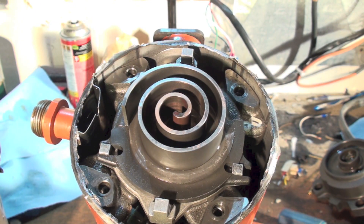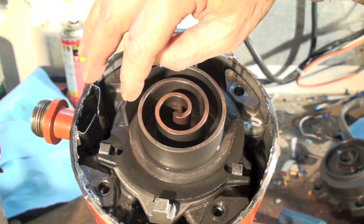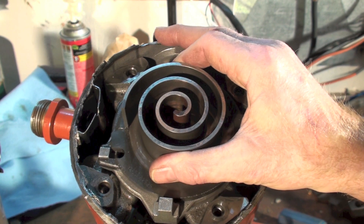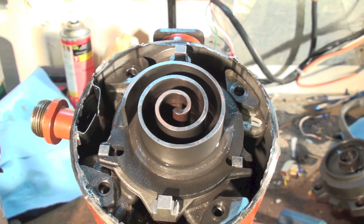The space gets smaller and smaller and it pumps the gas out. If you have liquid in there, instead of the scroll touching the other and making a close clearance, it'll actually back up a little bit — that's how much it'll back up — providing space for anything that gets in the scroll. If you get dirt in there it may just reduce the pumping so much it doesn't pump anymore, so don't pour dirt in the suction line.